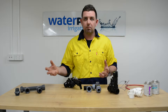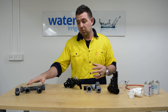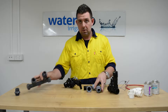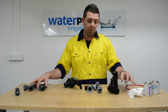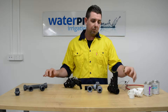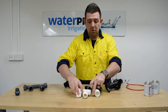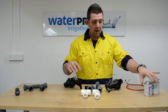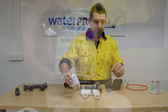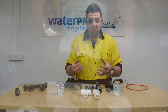The three ways that we can do it from our shop are to use the Spears system, the tablet system, or you can use a PVC manifolding system. The most inexpensive way to manifold is to use PVC. That's as simple as gluing together PVC fittings with PVC pipe and using primer and glue and thread tape to hold your system together.